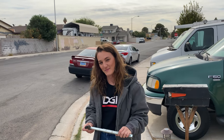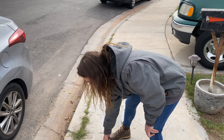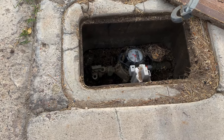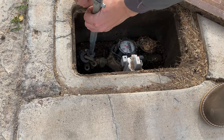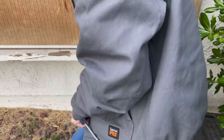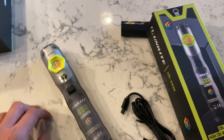We got the tank out of the way. Now we're about to turn the water off at the main. We want to relieve the pressure on the softener so we don't blow the o-rings off and get water in your face. Take off the lid, take the basin wrench, hook that on to that, and then just slowly match up the little holes together. Go ahead and relieve the pressure — turn her on. There we go, pressure's off.